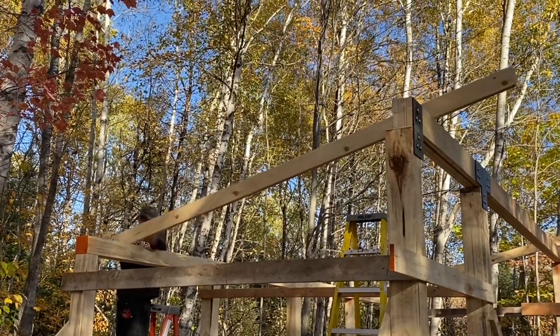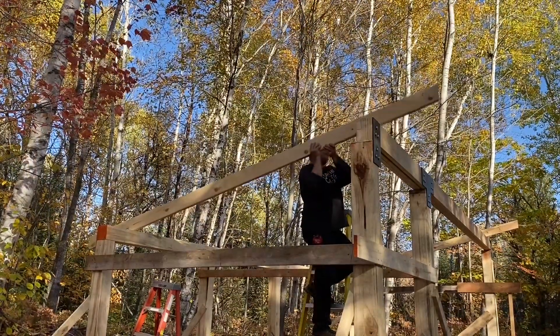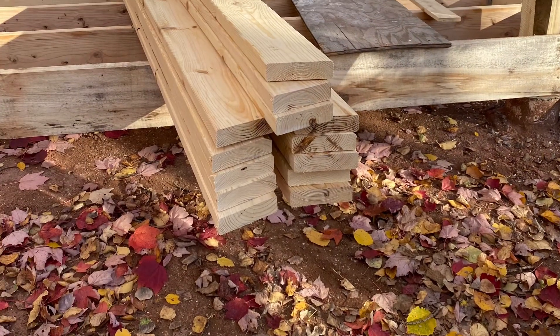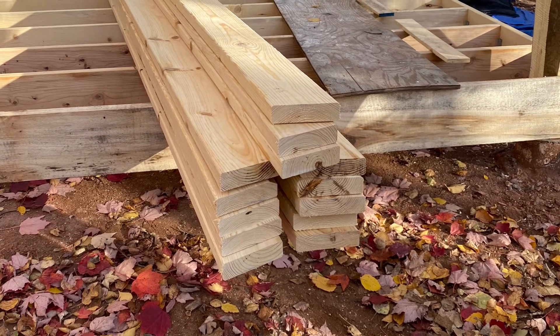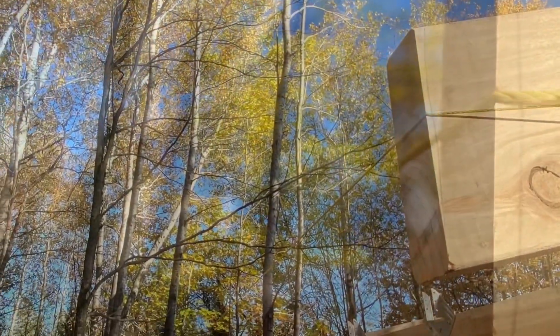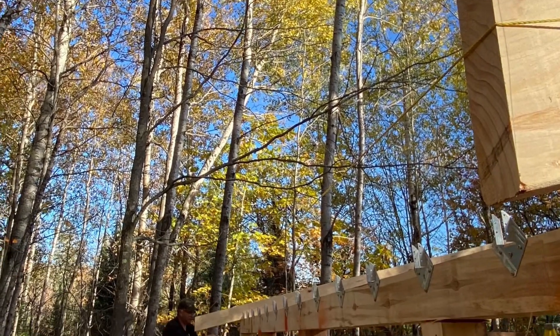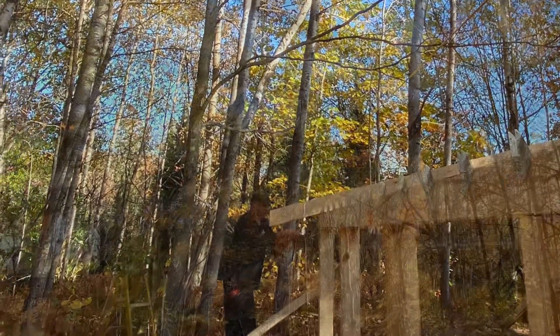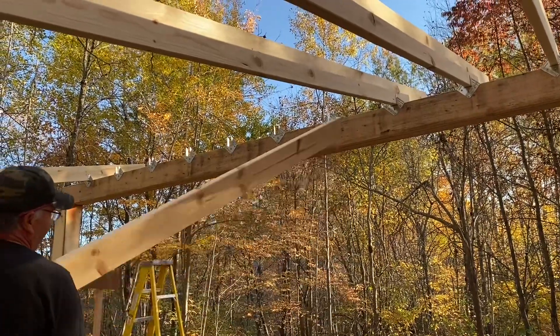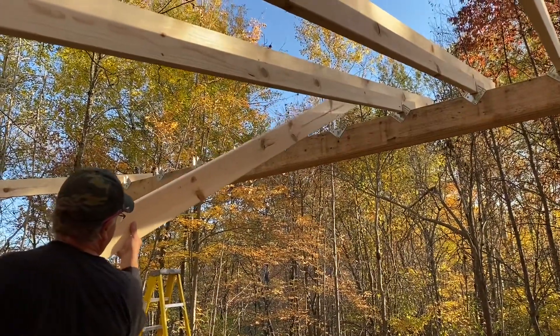This part of the roof definitely went quicker because we had done all of the rafter tie installation first. Then we were able to just burn through that pile of rafter boards. We ended up getting all the end cuts done on every board so we only had to have the generator running once. We put up some end pieces first so that a string line could be run, and then each rafter was just lined up along that. This saved a ton of time because they were all cut to the same length — we didn't have to do any extra measuring during install. We just set the rafter up there and backed it down to that string. Super efficient.